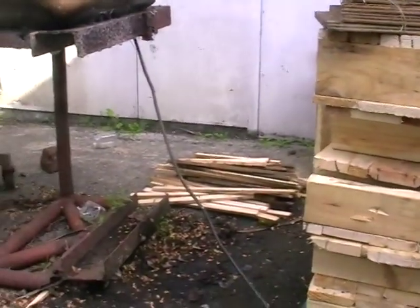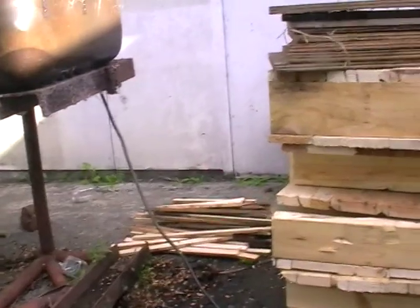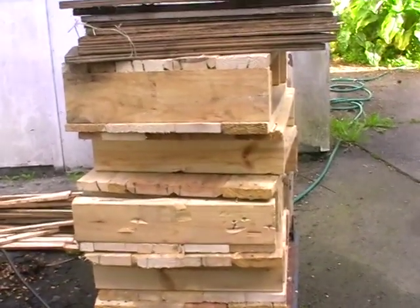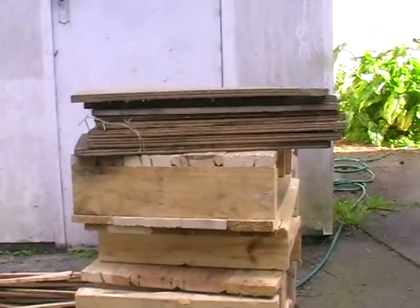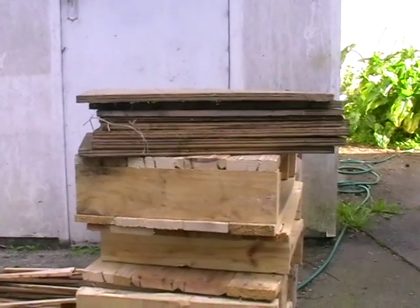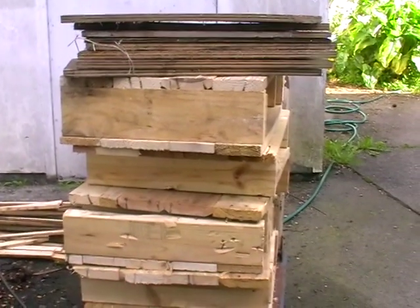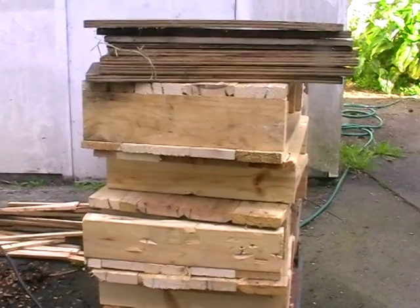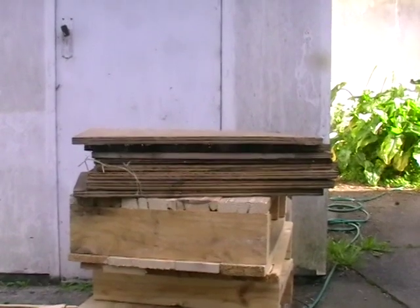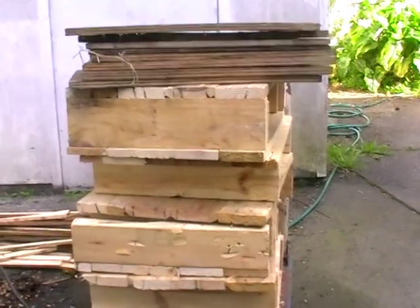There are also a lot of holes for nailing. I do them separately and nail them one afterwards, so the wax gets into the joints too. If I did not do that, the lifetime of this wood might be only two years, with things coming apart and borers getting into it. Certainly after the first winter it will be three times as heavy, filled with water and cold for the bees. So it is important that the wax sinks into the wood to prevent water getting in. No borer and no rot will take place — it is a preserving treatment.